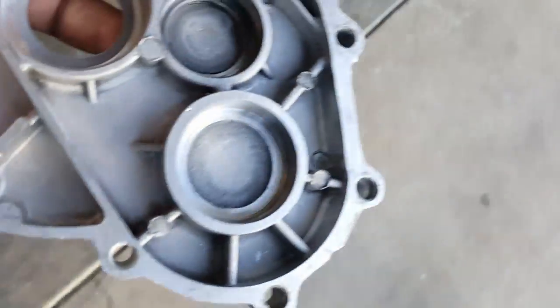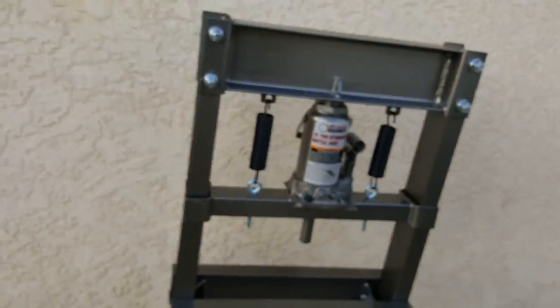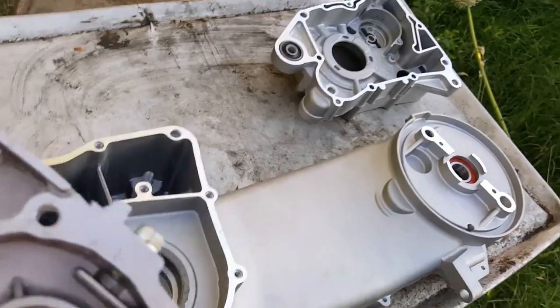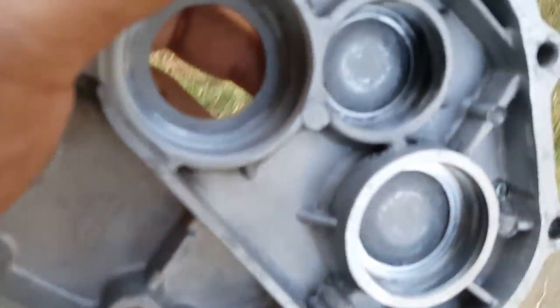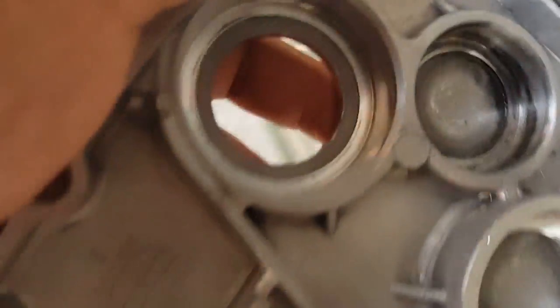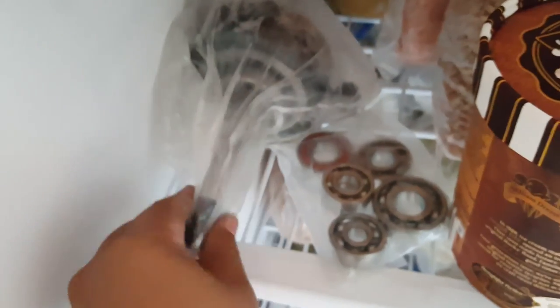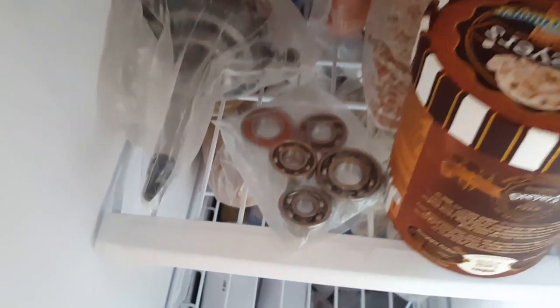You can see here we already have a few pieces set out to do that. Here we go — there's our compressor tool. We use a 12-ton compressor tool to get the gears. These are the ones we set out in the sunlight to heat up, and we've frozen the crankshaft and the other ones to prepare. You can see — past the ice cream — we've frozen the bearings. You can put them in the freezer for a couple hours, but you can also leave them for six or seven hours or even overnight. Whenever you get a chance to work on it, the colder the better — that way it contracts. Also, you can spray some WD-40 ahead of time on them to make sure they don't rust in the process of being frozen.